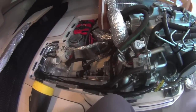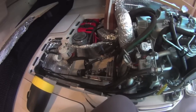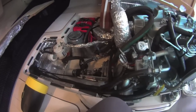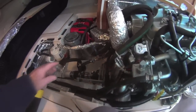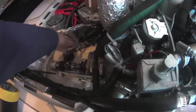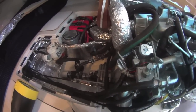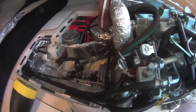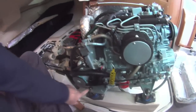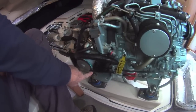I've got to make sure the water is shut off on this engine before I start anything. The main seacock for the engine is turned off. I also installed another seacock for the PSS seal because I found one time trying to drain the engine it just never stopped draining — it turns out it was back-feeding water up through the PSS shaft seal through into the raw water intake. So I put a ball valve on that to shut it off. Make sure that's shut.